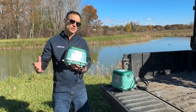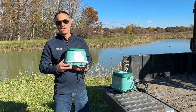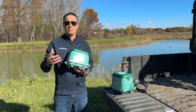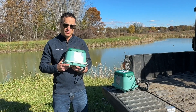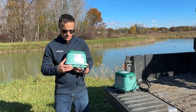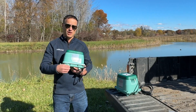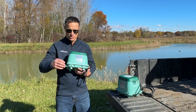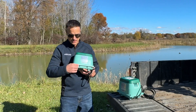If their pressure drops below a certain level — if that is not your application, if you have a pond and you're using this for pond aeration or any of the hundreds of other applications our pumps are used for, you do not need that barb. You really need to plug the hole, because that barb is going to allow air to escape and it's also going to make an annoying whistling sound.